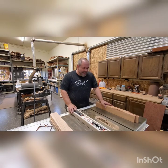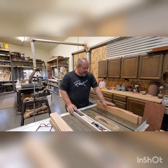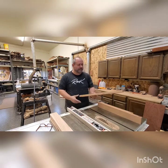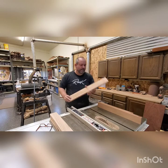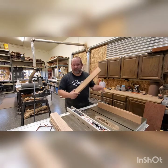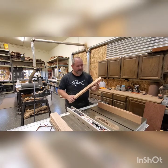I always start with my chop saw and table saw, cutting them to length and then to width. I'm not going to go over that because if you're building a guitar, I'm sure you know how to use a table saw and a chop saw. For mine, I get them at three and a quarter wide. That just accommodates my headstock, makes it easy so I can have a solid one piece without having any wings on it.